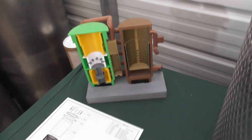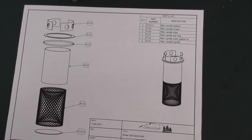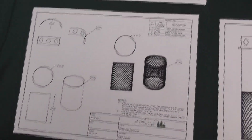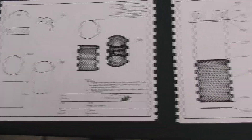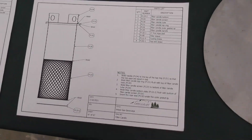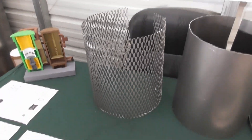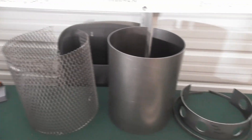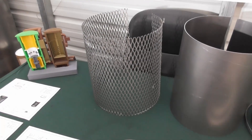This contains all the filter media for the gas. The assembly drawings we're looking at here show the filter candle basket — you can see the parts, another view of the parts, dimensions, and the overall assembly. What we've got is some expanded metal base, the filter candle tube, and the filter candle bottom.